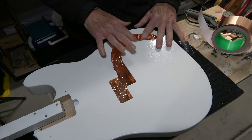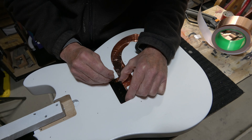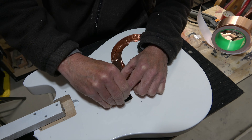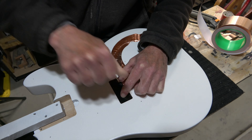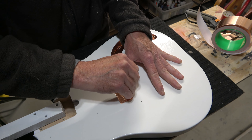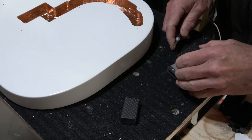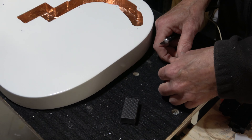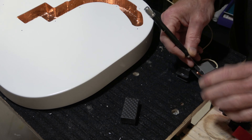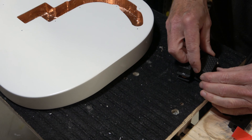Now let's get on with today's video. In this episode, what I'm going to be doing is the initial assembly of my 4-string bass guitar build. And as you can see, I've already done the initial assembly — everything has been installed, so I'm kind of going back in time. The reason why I do an initial assembly before I buff out the finish is because I know from experience that when you assemble a guitar, you can be fairly rough on that nicely buffed out high gloss shine, which can cause scratches and forces you to revisit that whole process of buffing, and in some cases level sanding as well. So to prevent that, I like to do my initial assembly now.